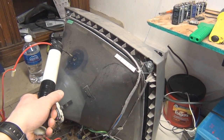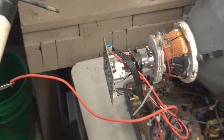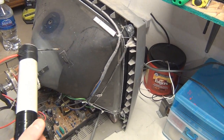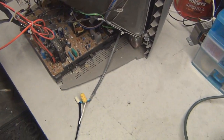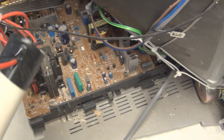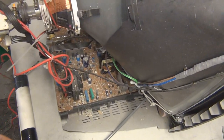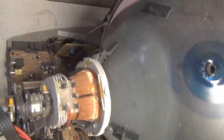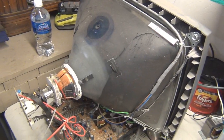You have to be careful with that back there. Yeah, you can have a lot of fun with these. I've taken a couple of these apart and just isolated the flyback — cut out the rest of the board and just used the transistor driver, the hot transistor, and the power circuit on that end. Then you splice them together, or you can use your own power circuit like the one I have here. That gives you a nice flyback driver. They're pretty hard to kill actually, so they're pretty fun to mess around with. Have fun and stay safe — see you in the next one.